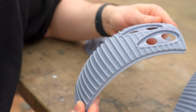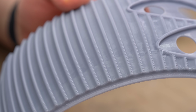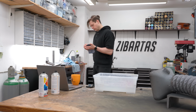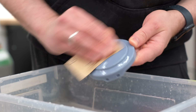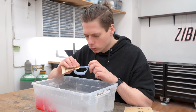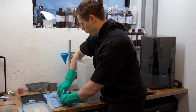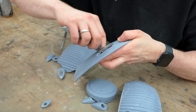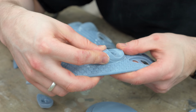Even with resin printing, there are layer lines or defects that must be taken care of, like this little groove on the side here. That means, you guessed it, hours and hours of wet sanding. My favorite. Sanding resin with 1500 grit paper is like rubbing it with a t-shirt, so you kind of need to get patient and learn to have fun with it. For sanity's sake, I did mix it up between sanding and production of other parts. To maintain this clean sci-fi look, I had to dial in the final fitment of parts by hand. It's a bit fiddly, but I think it's worth it.